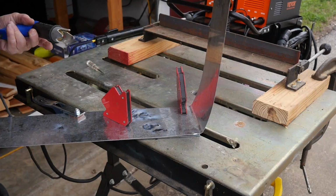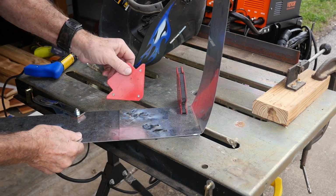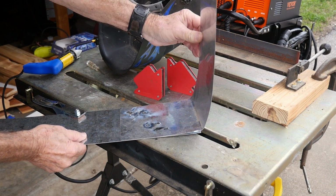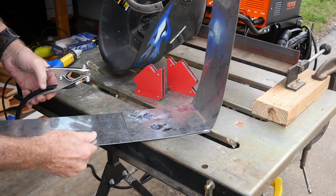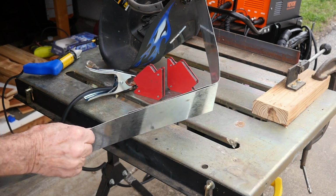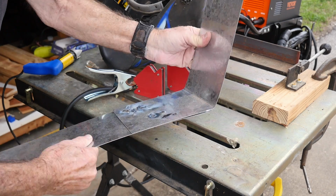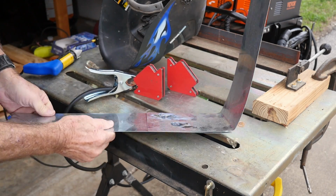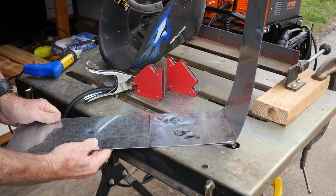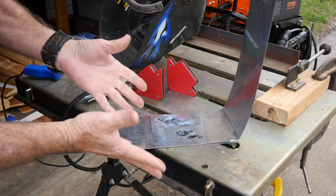That's more like a rivet at that point, but let's see if that stuck together at all. Yeah, that's at 100 amps. Oh, we actually have mechanical bonding going on here. So I guess some practice. Oh yeah, all right. Yeah, that is definitely stuck together. That is held, and you can see the heat right through the metal, and it's got kind of a crater-looking effect, but it did the job.